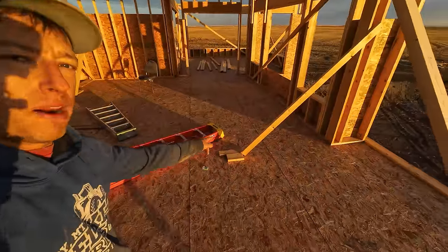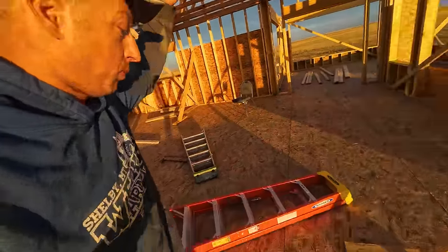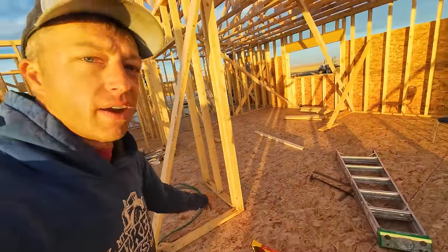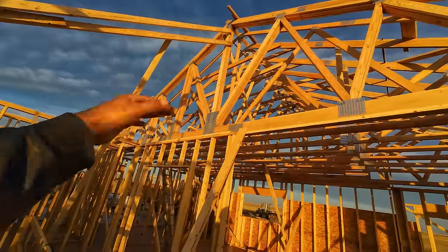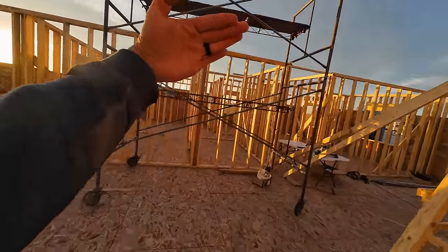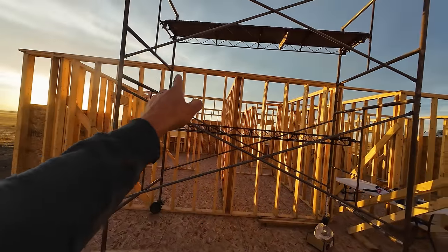There's no load-bearing walls under the floor down there, so you can't put the load of the vault pressing down here because there's nothing here to support it. And under the floor over here, there's nothing there. So that's why they had to make a girder truss. And that truss there will support all this weight hanging. This side's got a load bearing wall. That wall goes all the way down to the basement floor with footings underneath. So that can take the weight. Makes a lot of sense.